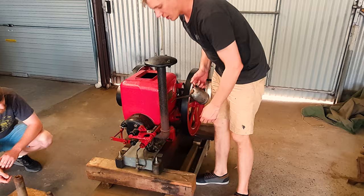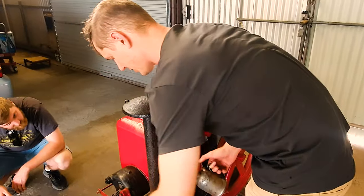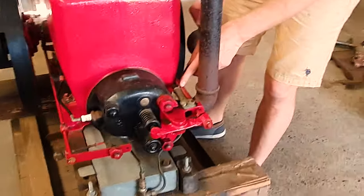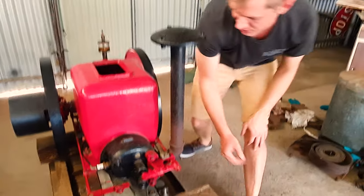So what we can do to increase our chances of that opening is basically put a little drop of oil right here onto this piston, which will help us to seal as we rotate through those revolutions.